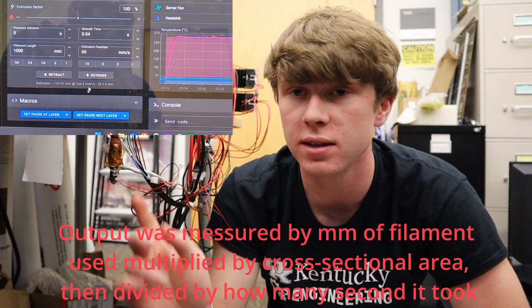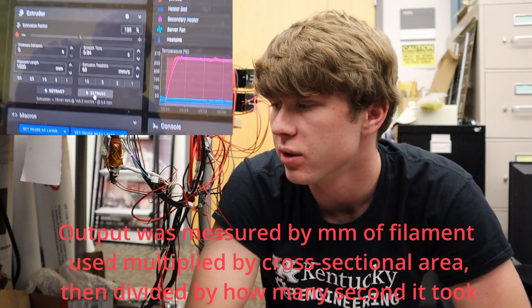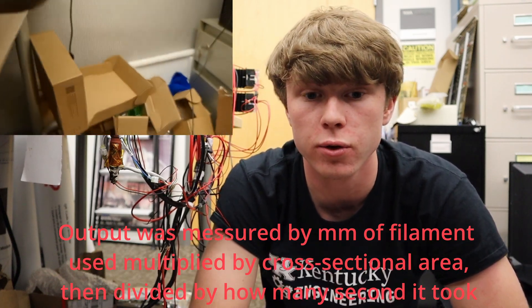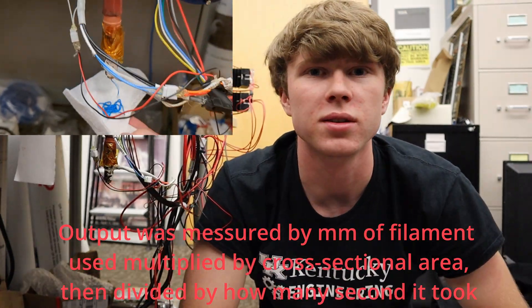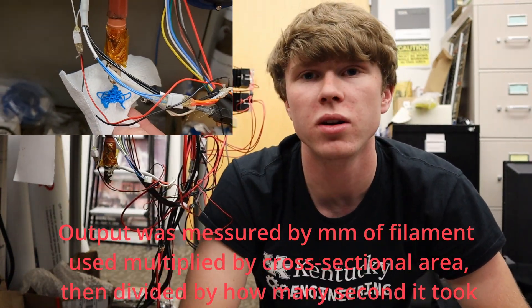As far as I know, this is the highest flow rate hotend out there. This is hitting a consistent 180 continuous flow and can get up to 240 — I've been able to hit that, though only in short bursts. All of this is done with a 0.4 millimeter nozzle at 285 degrees Celsius.